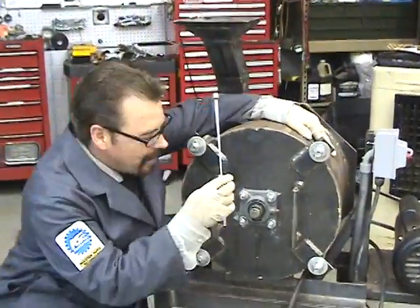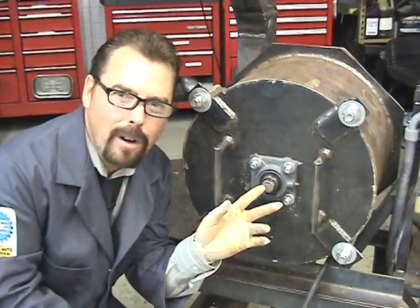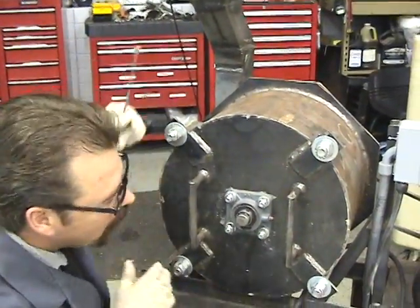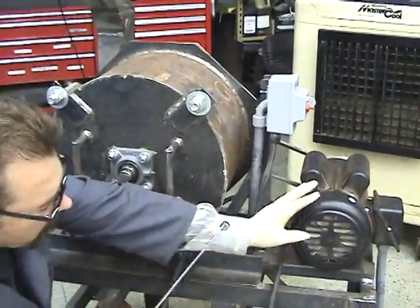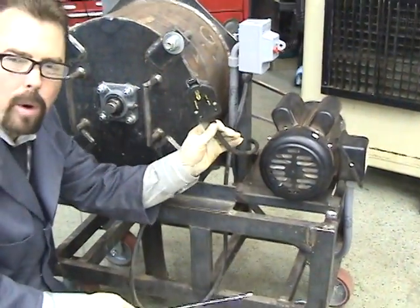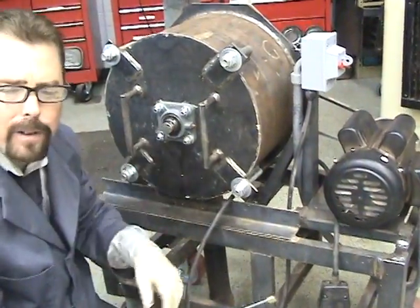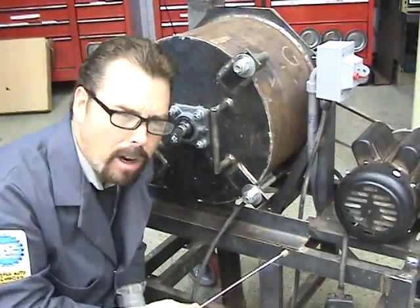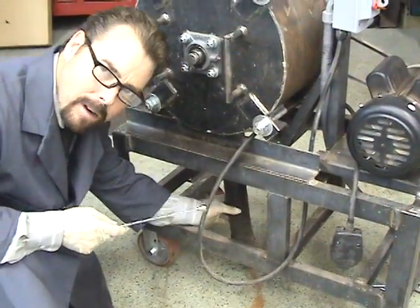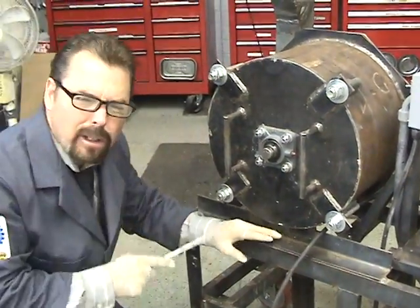Old Betsy here is 17 inches high and 10 inches deep. It's got a one-inch shaft running all the way through it, delivering pounding force to those little rocks. Now, the motor — the drive mechanism over here — is two horsepower, single phase, 220, delivering all the power we need to spin the center shaft to crush even the hardest of quartz rock. The discharge line is two and a half inch on the bottom, and it runs through a punch plate which brings it down to 100 mesh. Let's take a look inside.